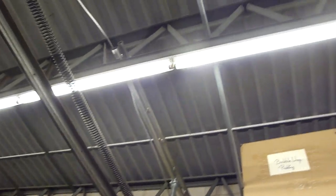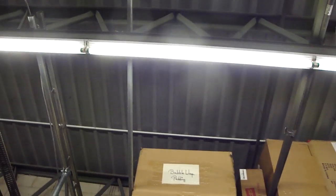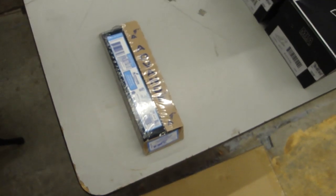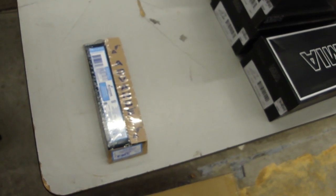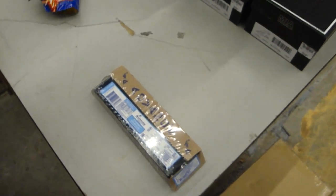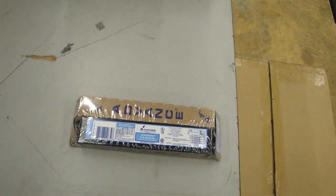And then we just peel back this skin on one of these fluorescent lights, remove one tube, so we have access to the ballast area. And of course then, as I said, remove the neutral wire and remove the hot wire secondly, and cap them, keep them off to the side, and connect them in last, connecting in the neutral wire first and then the hot wire as you finish connecting all the six color-coded wires. And this will give you the four-tube electronic ballast unit.